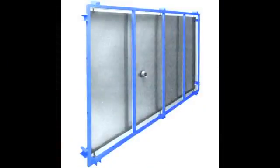big plates. It's called EMT, plate reverb. They'd have them down in the basement of the studio. They'd be about the size of a door on its side. And these plates were suspended, and it was the same idea. They would use these plates to reverberate and make the reverberation sound. And they would pull in dampers so that if you wanted a shorter reverb, they would pull these dampers in to dampen the vibrations of the plates, so it's a smaller, kind of a smaller room sound.